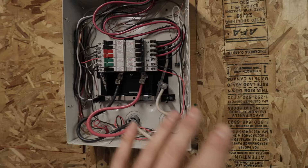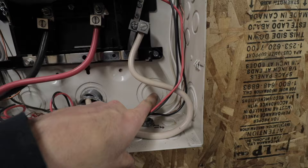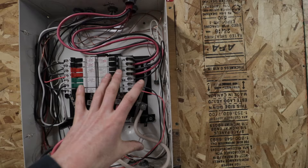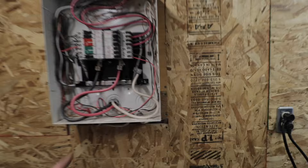The problem is the grommet where the power, ground, and neutral wire comes in for the fuse panel is in the center of the fuse box, and I need to move it to a hole a couple inches over. That'll shift the whole panel over and then the toolbox should fit perfectly. All the wires have some slack, so I can move it. I've got a hole saw kit — I'll drill that new hole out, and the old one will be right against the wall anyway. Then this should clear the toolbox.